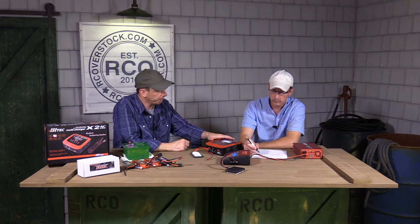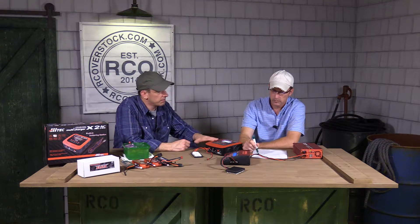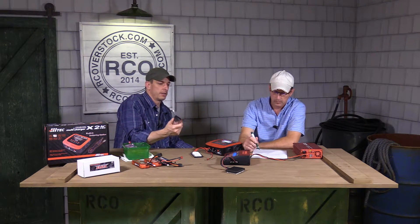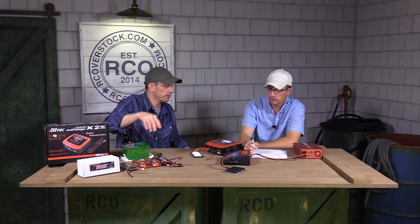How can you check it? What do the numbers mean? The numbers relatively should be low. We took a brand new Elite Series pack, threw it on the Thunder Power checker and also the X2 — we got a one milliohm variance between the two of them, showing one and two milliohms, which is just down there. That's fine for a brand new battery and you'd expect it out of a 55C pack. But you've got variance between the chargers — we're trying to get a line on a dipstick that doesn't have any writing on it.